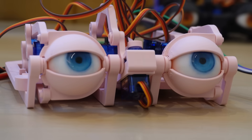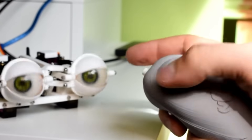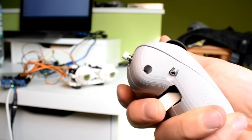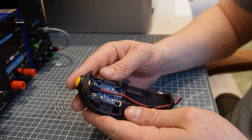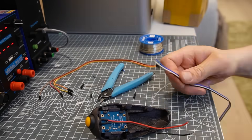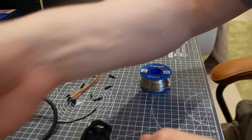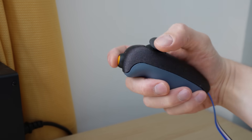Back in 2019, I made an entire 10-minute video about an iMech controller I designed, which was inspired by a Wii nunchuck. Controllers and small electronics housings are one of my favourite things to design, but since they actually perform very poorly on here, you'll have to make do with 30 seconds this time. In keeping with the snap-fit theme, I had to eliminate all screws from my controller. I massively overestimated how thick the latches needed to be to securely hold the joystick in, so I had to press very hard to get it in. But I got there, and once it was in I quickly soldered it by hand. I do want to make a proper go of this controller, so in a future video I want to try and make a wireless rechargeable design.